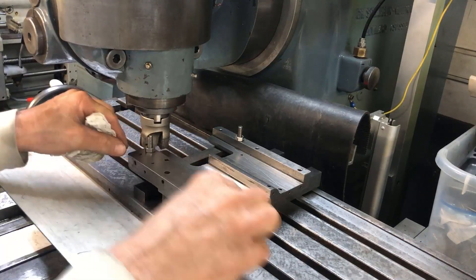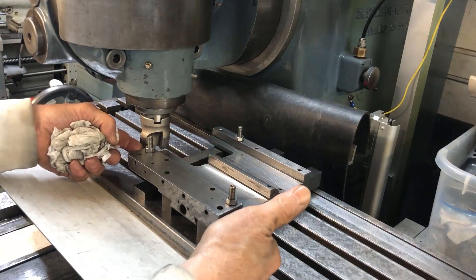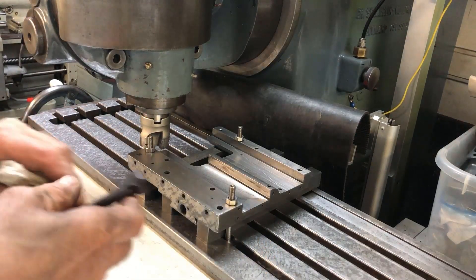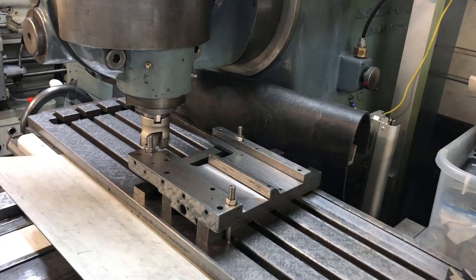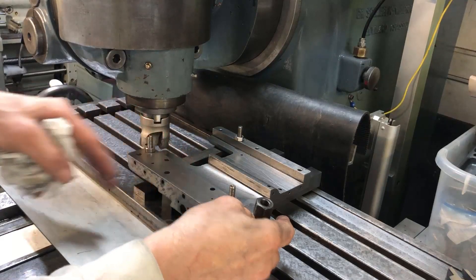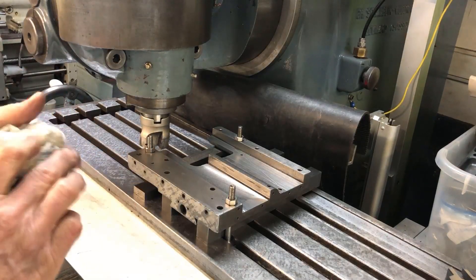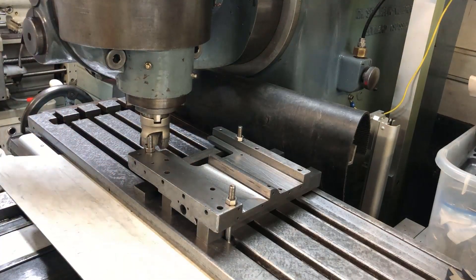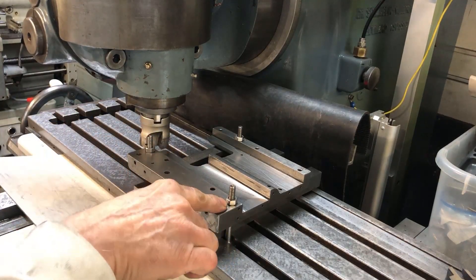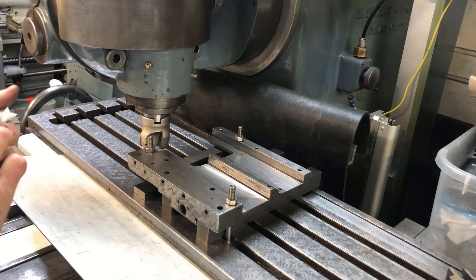And then I had to arrange it like this, which would be the first choice, also if it hadn't been for the fact that I couldn't clamp it in these slots with the normal T-nuts, because then it interferes with the milling envelope, or the milling cutter's path here. So I then turned down a few of these bolts to a little less than eight millimeters, and also then threaded them for eight millimeter, and we'll try them here.